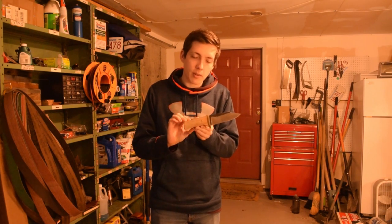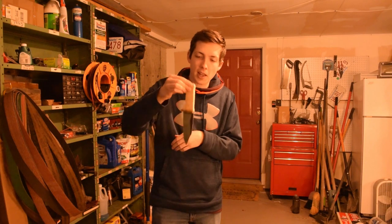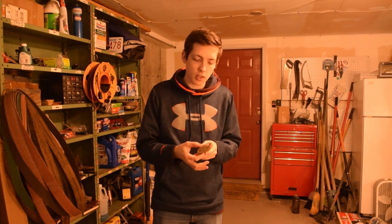I've ground out the profile of the handle and I'll leave it like that for now. I got the pin to the right size where it now fits into the handle and retains the knife. My next step is going to be to touch up the bolster with some sandpaper and then epoxy everything together and let it set overnight.